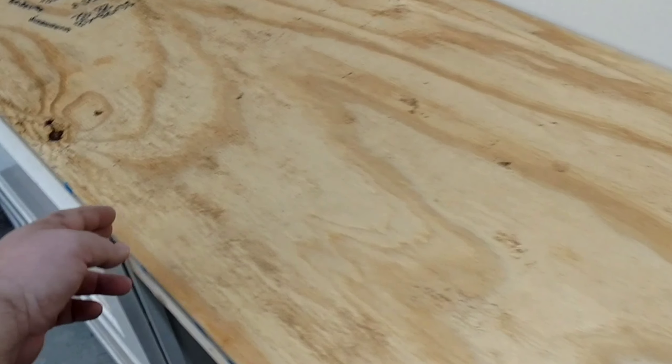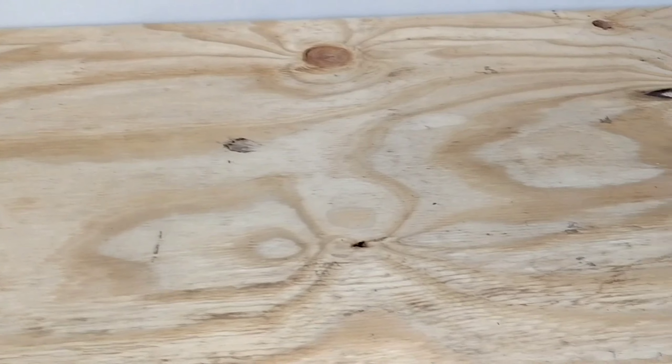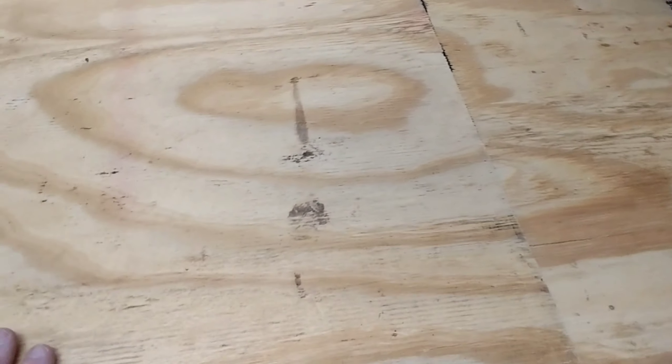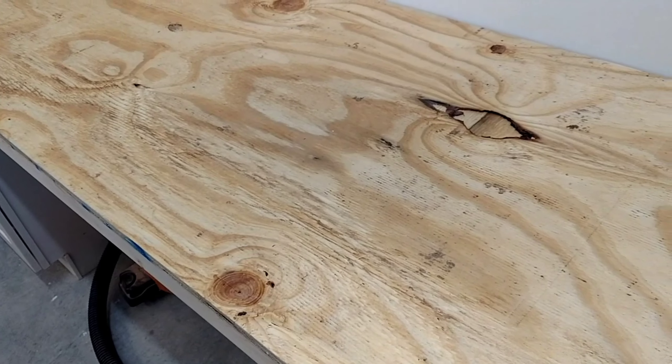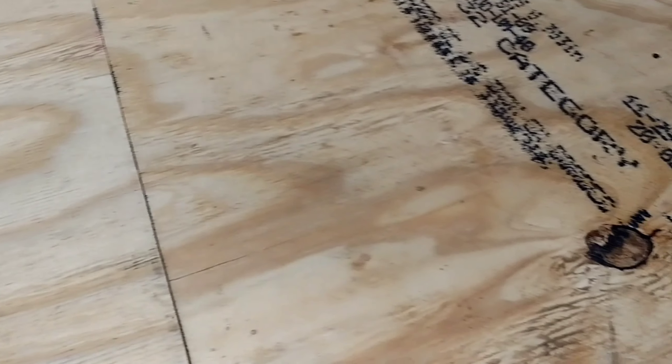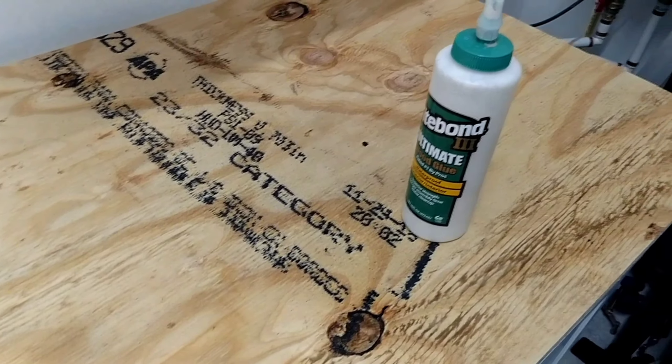Now we don't have to buy a third sheet of plywood. This space is 11 feet — we have 8 feet in here and I had to do a 32 and a half inch sheet right here. I'm going to glue this edge and take my other sheet, run it across this seam — it'll break somewhere about right here — then I'll put that sheet on, glue it, screw it, flip it over, and screw it to my surface. That's the plan at least.